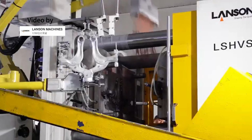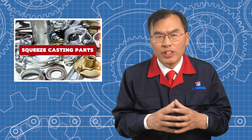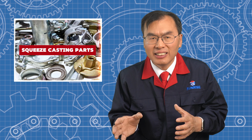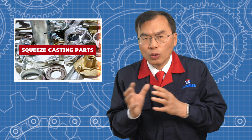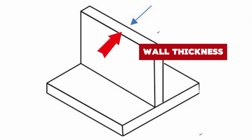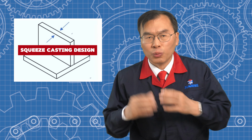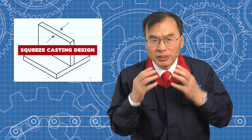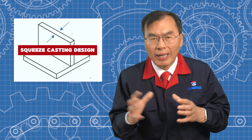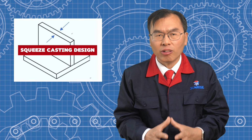Squeeze casting works best for solid parts with simple, strong shapes like arms, brackets, or thick sections. It's not ideal for deep undercuts or thin, complex features, since those can be hard to fill under pressure. During design, it helps to keep wall thickness uniform and avoid sharp transitions. That makes the metal flow more evenly and reduces the risk of defects. And since the process uses a closed die with direct pressure, things like parting line and ejection should be considered early on.